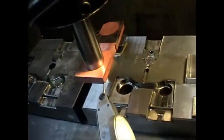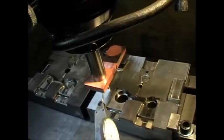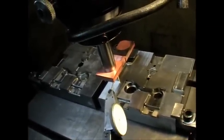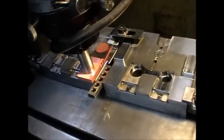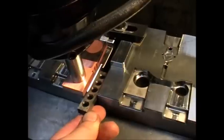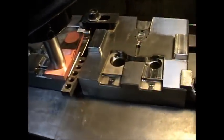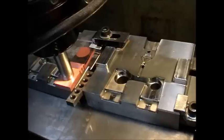When the electrode makes contact with the work, it makes electrical contact and a little beeper goes off. You can also use feeler gauges and set the electrode to the work within probably half a thousandth of an inch or a hundredth of a millimetre, and spark to those tolerances with a bit of care. Using a parallel on two datum surfaces in contact with the edge of the electrode, you set your digital readout to zero and index over — you can cut matching pockets and cavities on moulds and tools that are exactly or very closely aligned.